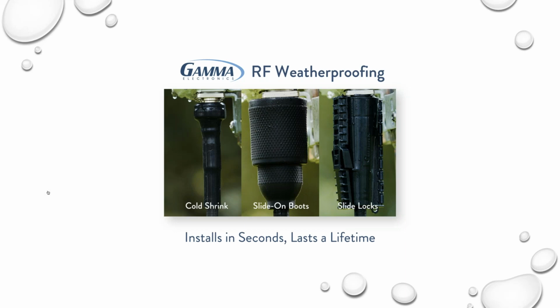And then can the magic tape be reused if the connector has to be removed for any reason? No, not really. The magic tape, because it kind of molds itself around that connection, when you cut it off, it pretty much has molded itself around it and it won't be reusable. But because there's no adhesive, it is pretty easy to cut off. Similar to cold shrink, they're both pretty easy to cut off. You just got to be careful. You don't want to nick the cable. And I don't want to say too much, but we're also working on a solution for that.